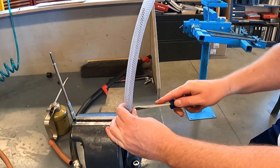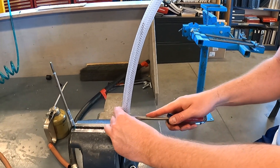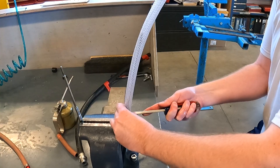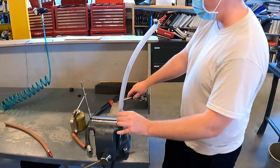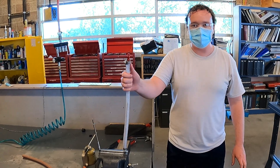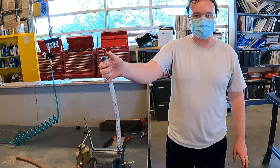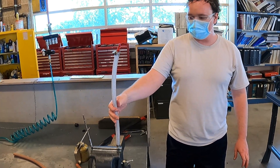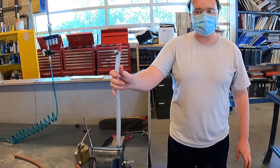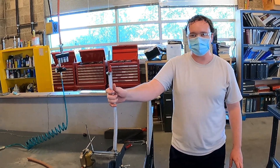Now I'm going to tighten this up, making sure that I do it snug because we're going to be putting between 60 to 80 PSI, depending on the tube, in order to actually press this oil that we're going to insert through this top bit right here, which is just a simple little air fitting. We're going to fill this up about halfway with some motor oil and then put some pressure on it and force the oil through.